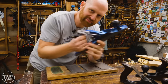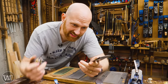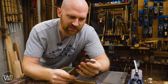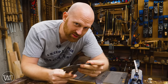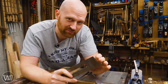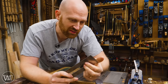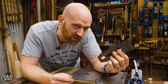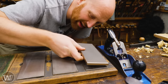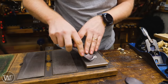One of the problems is this thing's got a curved iron — so how exactly do you sharpen it? The great thing is they don't have to be crazy sharp. You can really let these get relatively dull before you have to tear them apart and sharpen them. When I was using them all the time, I would generally only sharpen once a year, maybe once every six months. Now they are easier to push when they're sharp, but when they get relatively dull, they still work. If you let them get really dull, you might not be able to do it — that's why I often break out one of my extra extra coarse plates. This is one from DFM Toolworks because this will march through it a lot faster and I can get that burr exactly where I want it.